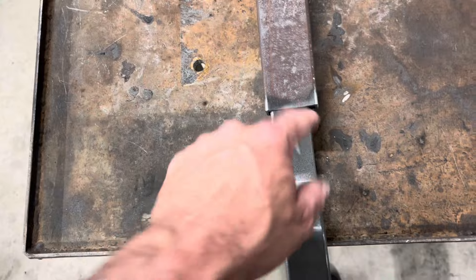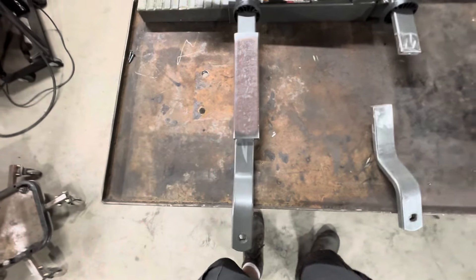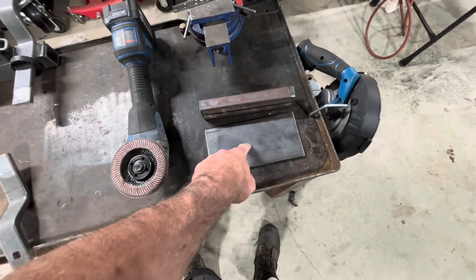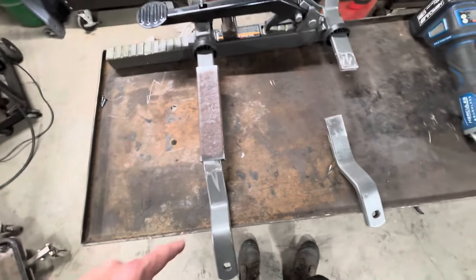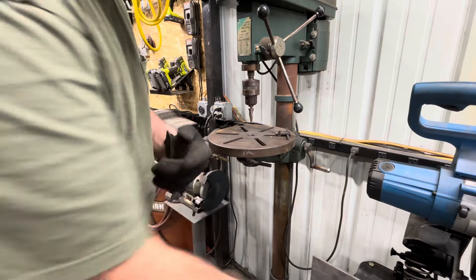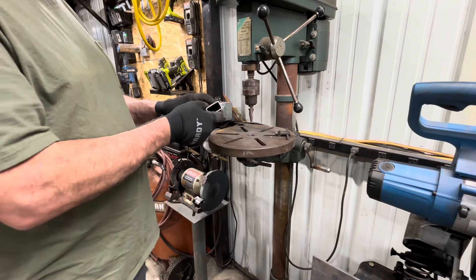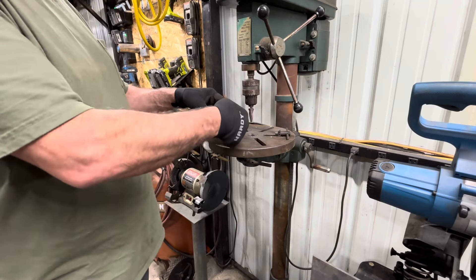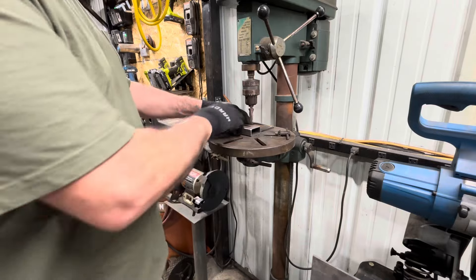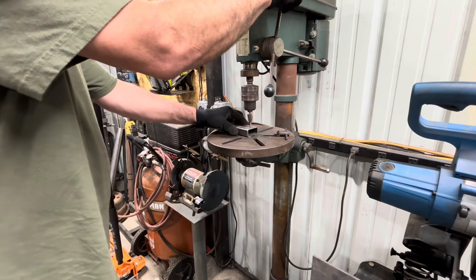Now we've got our pieces cut for the extension. These will go on here to extend it out, and this piece will go in between - there's a pretty good gap there. I just bring it to the middle and it seems to work out. So it's going to be like that, straightened and welded together. There's one more thing I'm going to do to these bars: I'm going to drill a hole in the end of it right here. It's going to end up being a plug weld, but it's also to help clamp the three pieces together, because I need to clamp through the original piece through this to bring it up to one. We're going to drill these holes - it doesn't really matter where they're at as long as they're towards the end a little bit, within the one inch, they'll be in the gap.